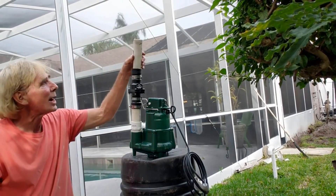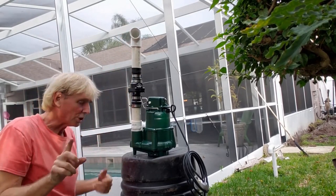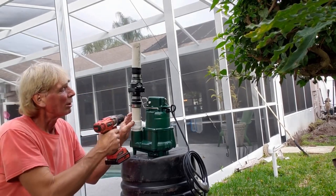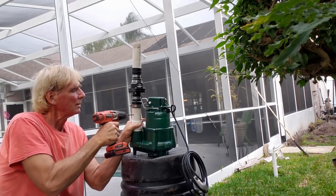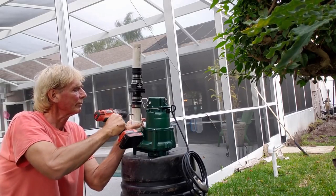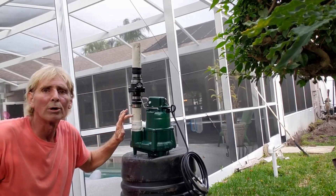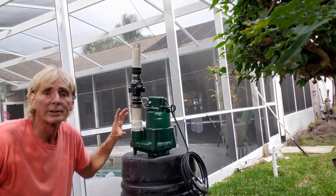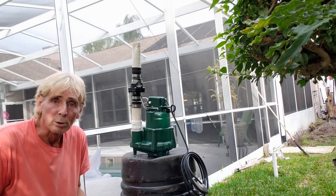When we go over to the sump basin, we'll have another riser that comes up out of the top, and it's going to turn with a 90-degree elbow and discharge — that's going to send it out to the front walk. Finally, we're going to drill a 3/16-inch hole right here. This hole is a pressure relief so that nothing can get airlocked. We've got a check valve and we don't want it to get airlocked, otherwise it won't pull up any water. So we're ready to go ahead and set the basin, the pump, and install the whole system all at once.